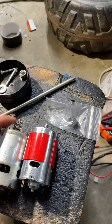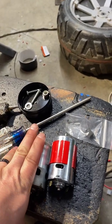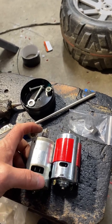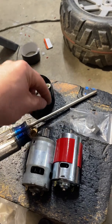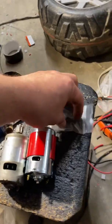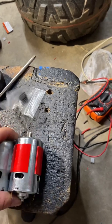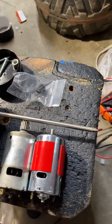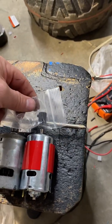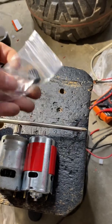If you're gonna try and get the old one off, put it in the freezer, then take it out, heat this with a torch, and then use a little gear puller to pull it. But this set screw version is easier. What I did was I used an envelope or something flat to make sure it was the same distance, and I slid this little gear on here until it was even.